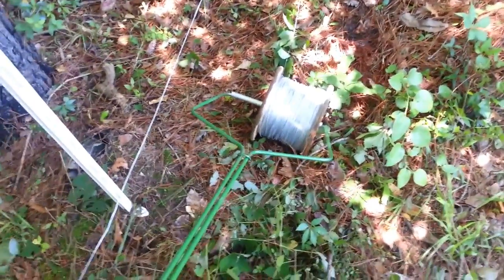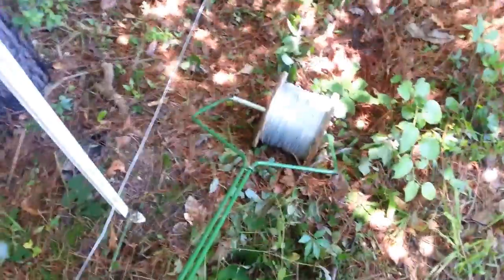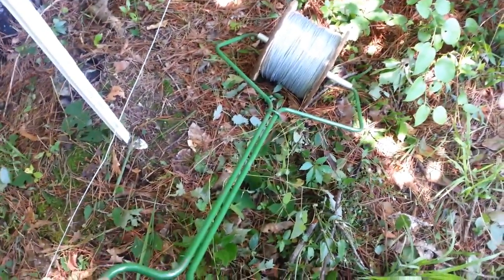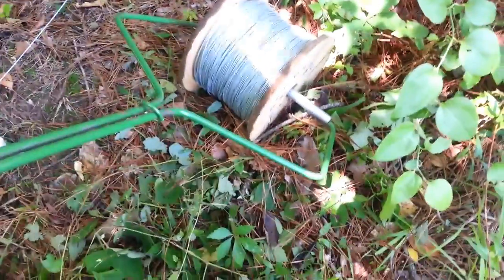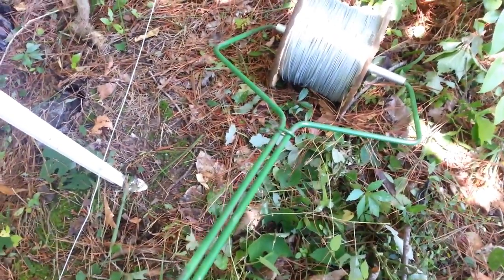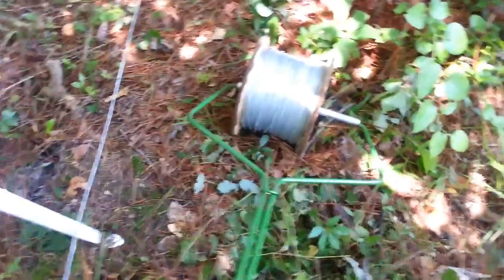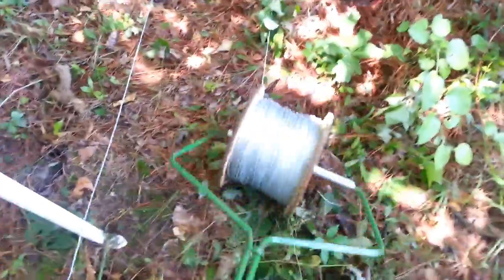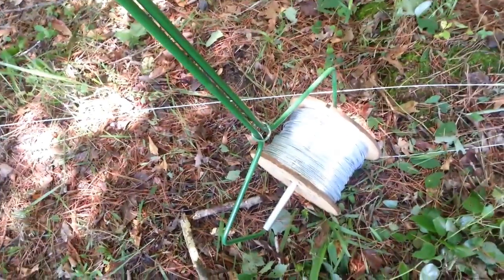Of all the things I had to buy — connectors, poles, controller wire, and so on — the thing I'm most happy with is this little wire spool dolly. It's nothing more complicated than a bent piece of metal connected together; the axle is just a piece of EMT pipe. You raise that ring up at the collar, it spreads open, and you can take the spool off. That's a half-mile of 14-gauge galvanized steel wire, and you can imagine how much that weighs — but with this dolly I just tugged it along with very little effort. Definitely worth the investment for long hauls. And if I can give one piece of advice: do this when it's cool, not when it's 90 degrees and humid outside.